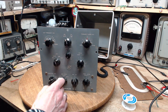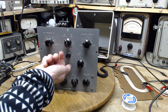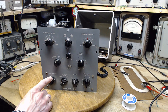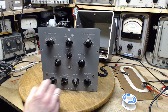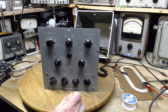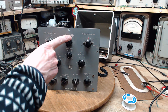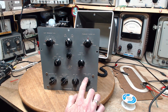The AGC control has slow, medium, and fast settings. Slot depth — so that notch filter, you can control how deep the notch is by turning this, which is quite interesting. This is the on/off and audio volume control. Here it has selectivity with three settings — it's set to three right now, six altogether on both sidebands for AM or upper/lower. It has a built-in BFO. When you flip it up to CW or single sideband, it automatically kicks in the BFO and then this is adjusting the BFO a little bit. It also has a noise limiter which doubles as a squelch control, which is a little bit unusual.